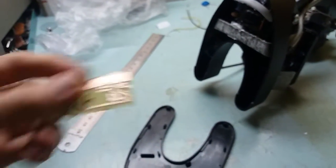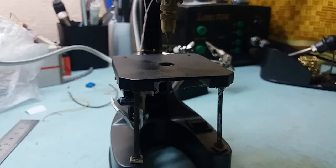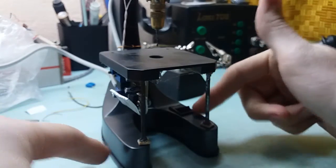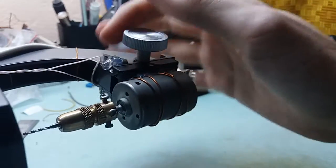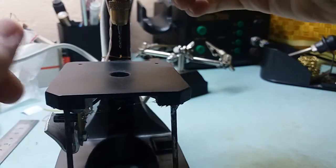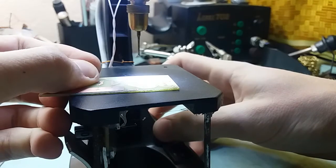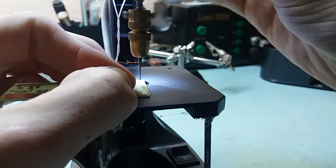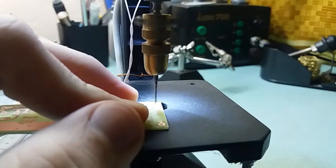So let's try to drill something in the circuit board. I forgot to mention — all the links, of course, to a schematic of the smart drill and a schematic of the power supply, you can find in the description as always. I also forgot to mention: I have included these 5mm LEDs to light up the table, which you will see right now. Let's go drilling. The drill, by the way, is a 1.3mm carbide bit, which I use for the wire pads. Without further ado, it's drilling time. Hopefully you'll be able to see it.